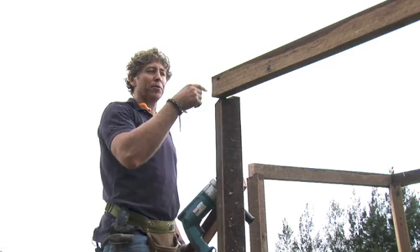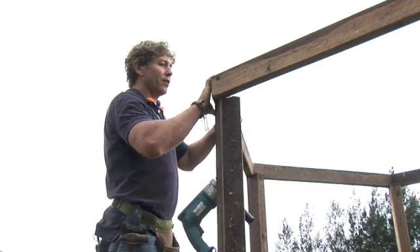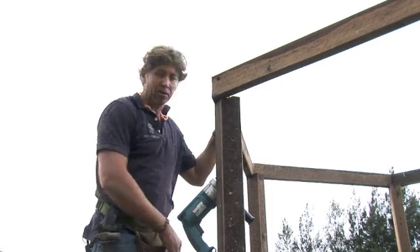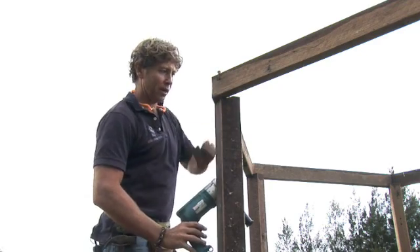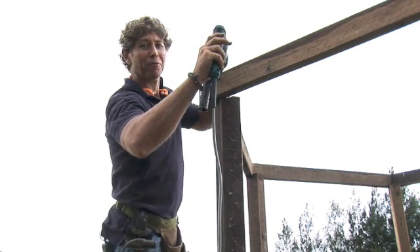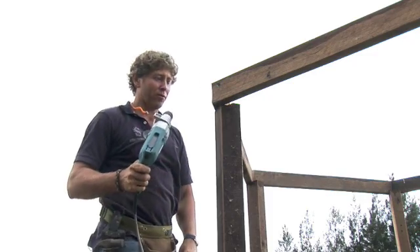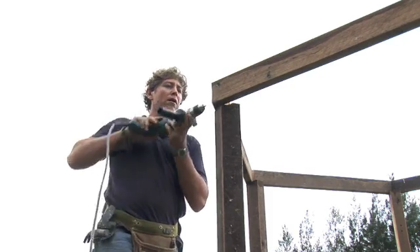Once you've done the posts, it's time to put the top trimmers around. What I'm doing at the moment — I've already got some of them in. The initial thing we need to do is to just screw them together at their intersection. I've laid these out in the workshop and numbered each joint and pre-drilled all the holes, so that's going to make life a bit easier. We're going to pop a 75mm batten screw in there, and screw that together. I'll just put one in from the other side as well — that keeps that whole intersection looking great.